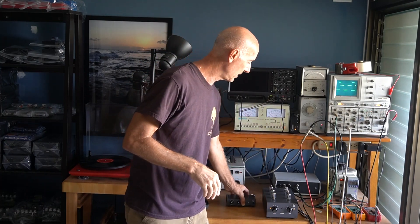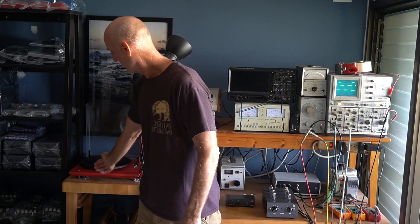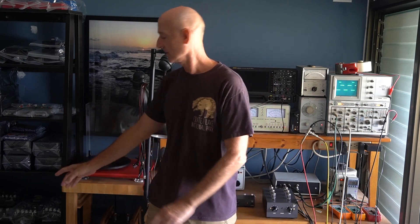Not that loud. I know that was amplified, but that is a very nice noise floor hiss. So when you're playing a record and you put the needle in the leading groove, the lead out, or between songs, that should be as quiet as your system gets. You should hear that noise and not your phono stage hiss — the phono stage hiss should be below that. And if so, you're doing great. You're going to have an outstanding system.